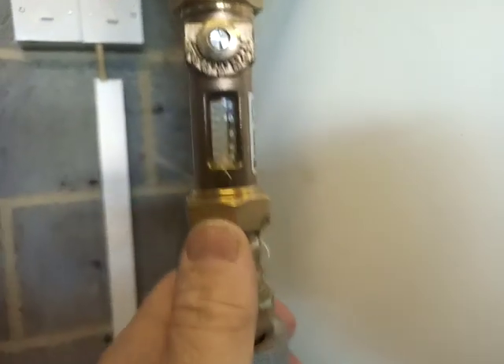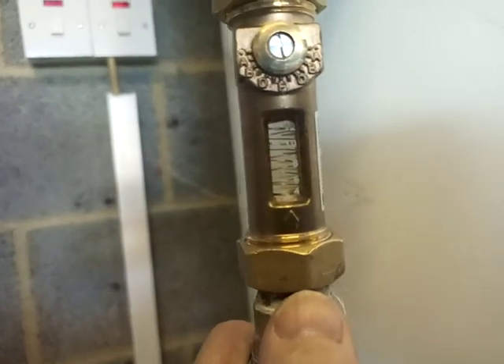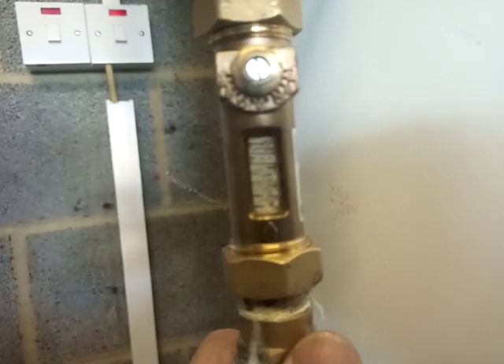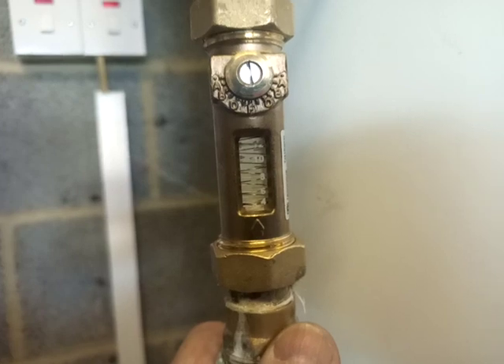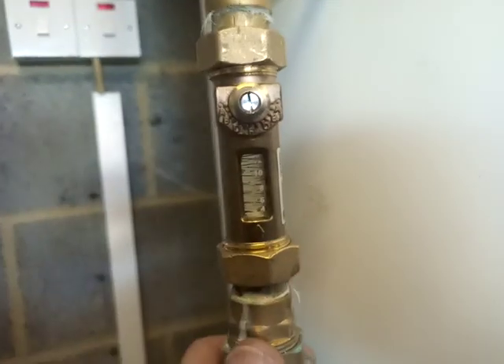The minimum flow showing is four litres, so I may have some small amount of flow up to four litres through it that I can't see. But certainly one, two, or three litres a minute isn't going to make a huge difference when running a tap.